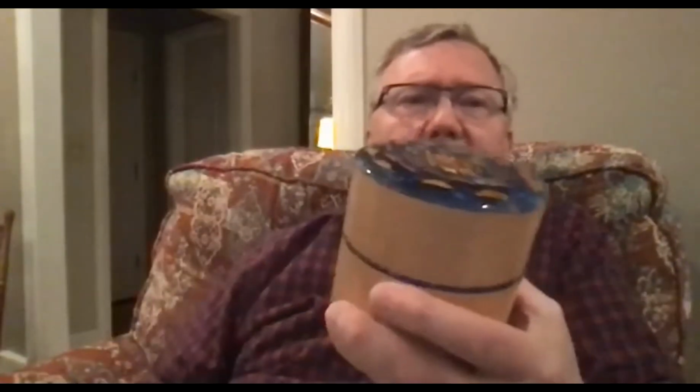Yep. Another thing that can help with some of those is a stabilization setup. If you can do any stabilizing, you can do a lot more with some of that. Some of those like magnolia pods or pine cones, you can make a little bit more firm, especially if they're pretty brittle. Well, they get totally poured in the resin, which is the stabilizer. Right. There's a stabilizing resin, and sometimes if there's too much moisture content, you can get them super dry, but if it's really brittle, a lot of the resin will get absorbed into it, which helps. But a stabilizing resin can also help with that.